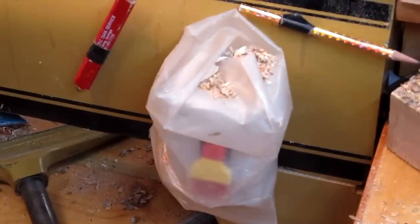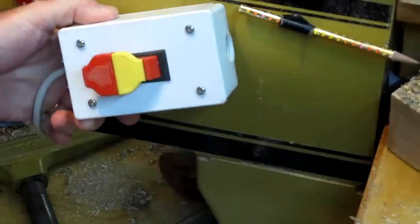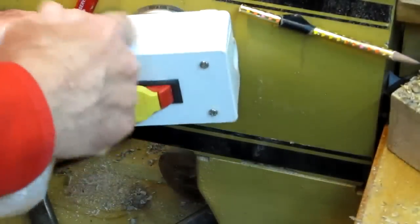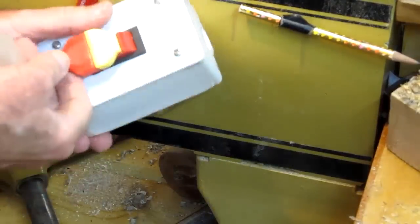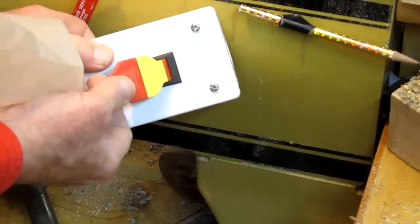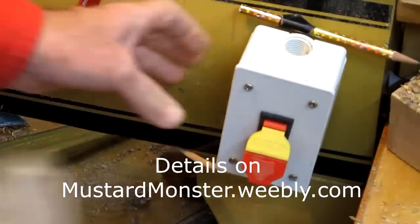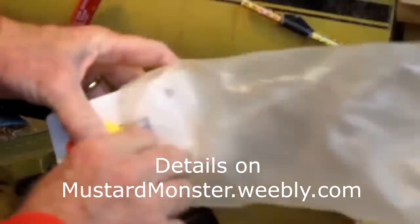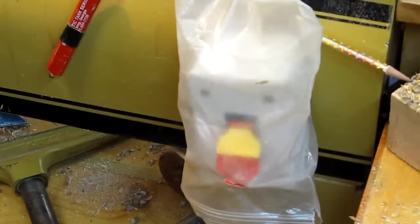This shutoff emergency cut-off switch I made — take the plastic bag off and you can see it better. Basically it's got a big magnet, it's an indoor/outdoor waterproof box with a sealed foam gasket, and it simply has a paddle switch I got from Grizzly to turn it on and off. I keep it near the end of the lathe and cover it with this plastic bag to keep chips out. One of the best features is that to make it truly work, I have to use it a lot — so if I'm in an emergency, I will automatically shut it off.